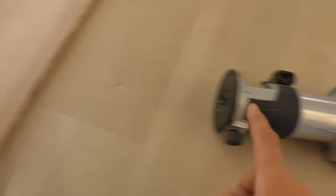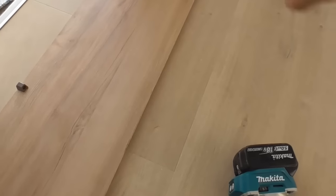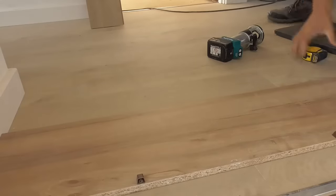What I've got here is just a bit of board. I'll run that up against those bits of architrave there as a guide — it'll help me steady this router rather than do it freehand. I'll just use that as a guide to run down there, then pack something in behind it and run it further down. So let's get that pocket cut out of there first. Right, here we go, let's see how we get on.